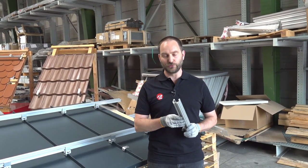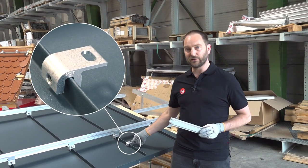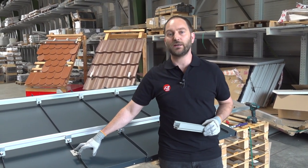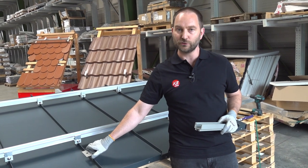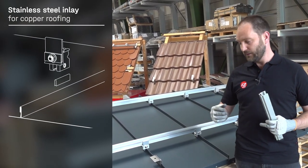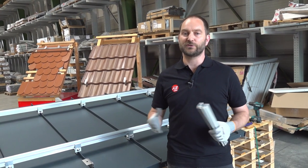You can plan your PV project with our calculation tool K2 Base and also print and create your static report of the project. On a double seam roof you can also use our solid rail. This one has a channel on the bottom side and therefore can be used in connection with a T-bolt. The T-bolt is inserted in this S5 clamp or in this stainless seam clamp. The stainless seam clamp is also compatible with a copper roof. As you might know, copper and aluminium don't like each other too much, so the stainless steel clamp is one solution, but the aluminium clamps can also be used on a copper roof — you then need an additional part, a so-called inlay, which acts as a border between aluminium and copper so they don't touch each other and there is no corrosional effect.